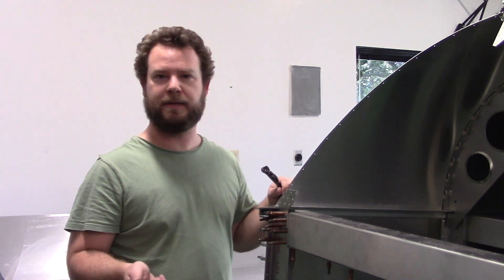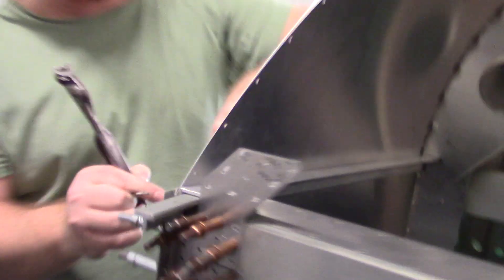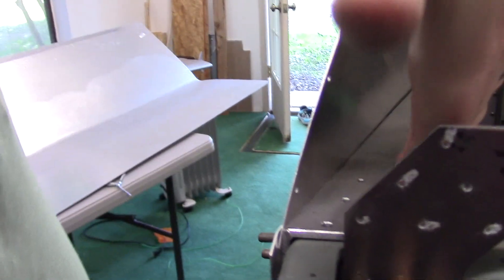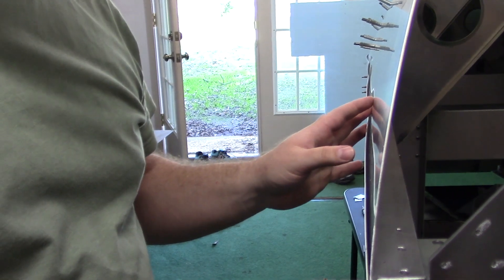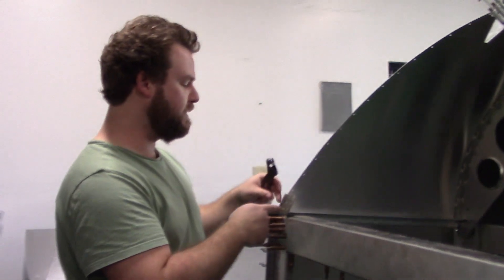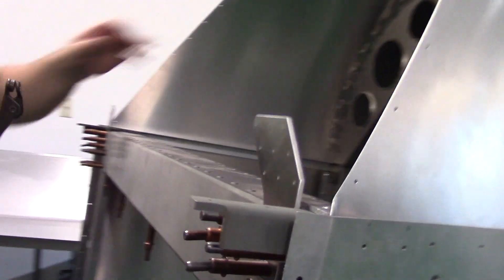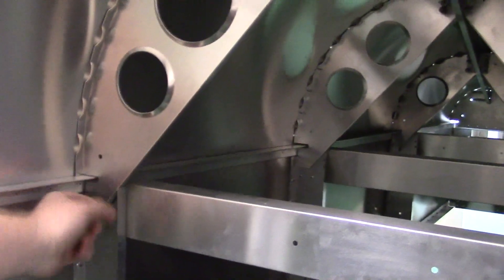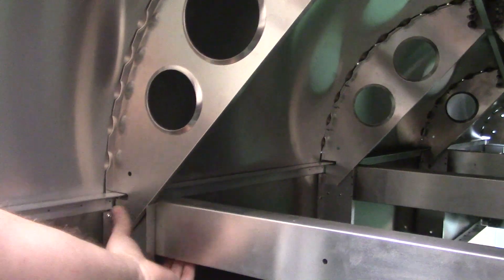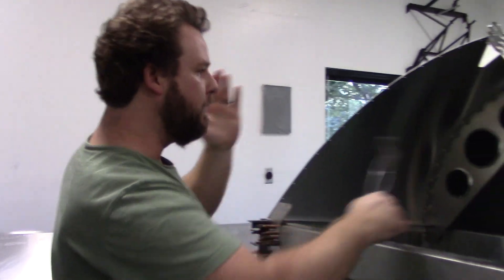So it was a super successful day. I went ahead and finished putting in the outer skin — it goes on the inside between the outer half-tub skin and the inner longeron. Katie helped me a lot; it was really kind of tough to get it in there. While I was getting that ready, I popped these two brackets in. This particular box here is where the back of the seat will drill in. Once I got those in, eventually I'll have to pop them out and bend them so they go up flush against this panel. I really wanted to get these in so you can see where the longeron kind of splits where this rib is, and I'm going to clamp all these down and get it really tight and proper.